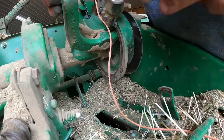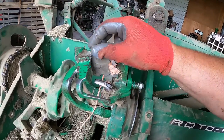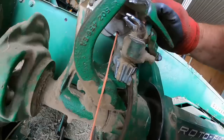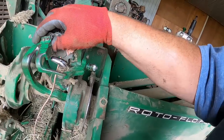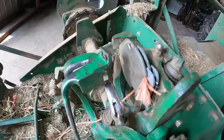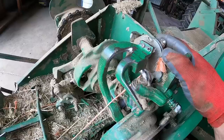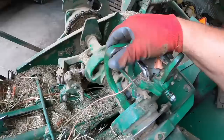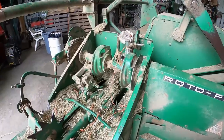Watch the fingers. Got to get it rotated up here because as it comes across the bill hook, that's where it swipes the knot off. I think that's supposed to be a little closer too — I'll have to try to adjust that. The knife's got to get past the bill hook there, so it's got to be in a certain position because as it comes around that cam action forces the arm in and out like it's normally supposed to do when it rotates. It's got to be in a certain position.